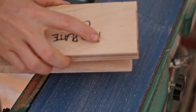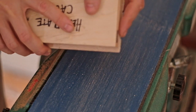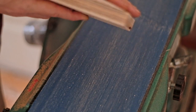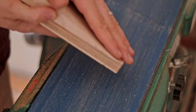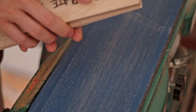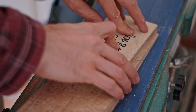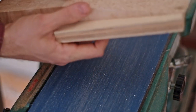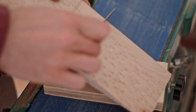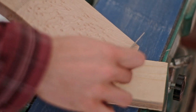By holding a flat block onto the wedge, I can put support right on the very leading edge and still keep the thin end from flexing and becoming not flat on the sanding side. A block all the way to the end is advised for getting pressure to that spot. Now it looks like I'm pretty good — I'm pretty happy with that. Looks nice and flat.